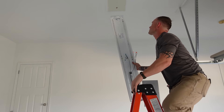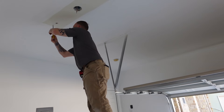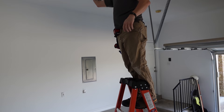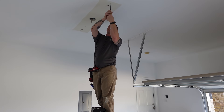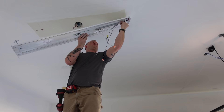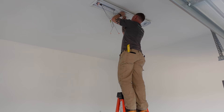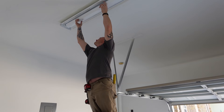Now that we have the first fixture up, all we have to do is repeat the same process for the second fixture. This one, the holes did not line up — the two existing fixtures were different — so I had to put new holes up there. I measured out the fixture, marked the holes above, and took my keyhole saw. You could use a paddle bit or other tools, but I just stabbed the keyhole saw up there, wiggled and twisted it around a bit, and that makes a perfect size hole for the larger toggle bolts. This fixture also had really short wires in the outlet box, so I extended the ballast leads a little longer, then secured everything, put the belly pan in and the lens cover on.